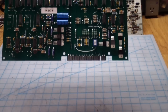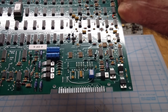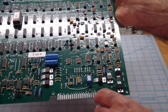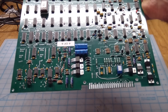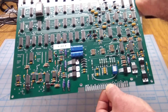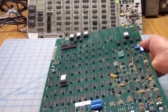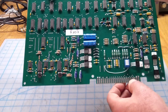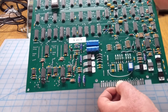That does bring me to my second point — if you look at the edge connector, it's really not plated. Maybe it is thinly tin-plated; I'm no expert in that. But I think this would be a problem. It's already showing some slight marks of use after being inserted less than a handful of times. This needs to be plated with whatever the originals are plated with — thin gold, whatever. Whatever doesn't cost a whole lot but makes this more durable and a bit thicker, so the contacts would work better. We measured the thickness of the board with contacts against the original and the numbers seem to match, so it's not that this part is too thin. But my recommendation is definitely to plate this with something for better connectivity and more longevity.